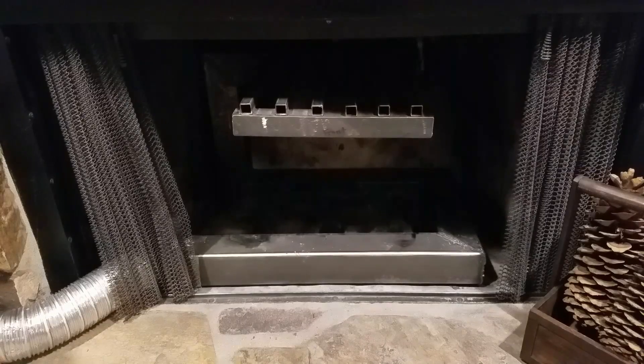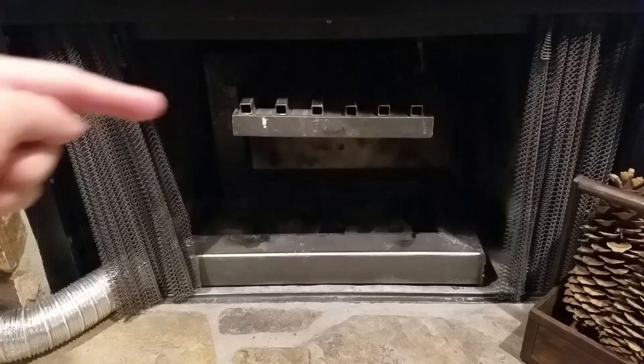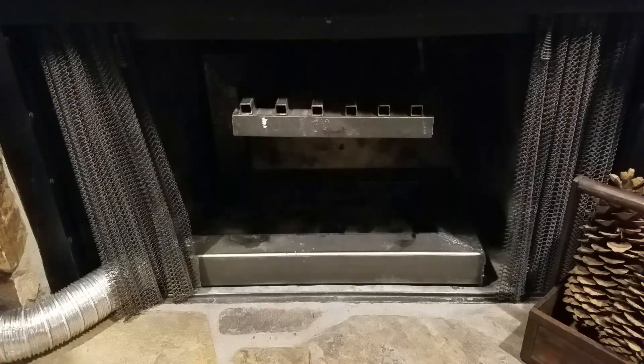Thanks for watching the video so far. Just wanted to make a few points to clarify some things. First off, this actually did heat my room compared to my old fireplace that didn't do anything. It went from 68 degrees to 72 degrees in my larger living room with vaulted ceilings, so performance-wise it actually works. Things I would change: these heat pipes along the top — I would definitely use a larger diameter tubing. I just used what I had because I didn't want to spend any money, this is all metal I had laying around. I think I could get a little bit more velocity and the air could come further out into the room and heat it up faster. Even though it was heating up the room, I think it could do a little bit better job.